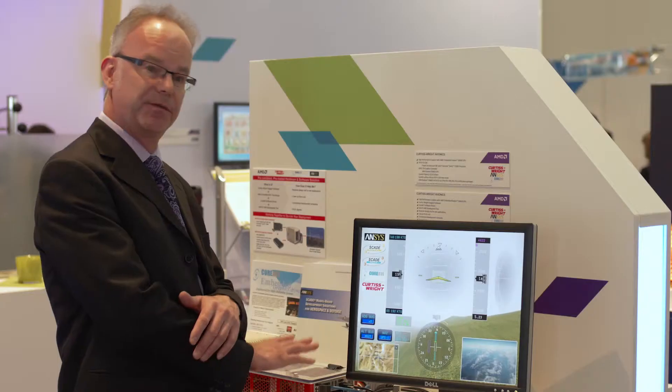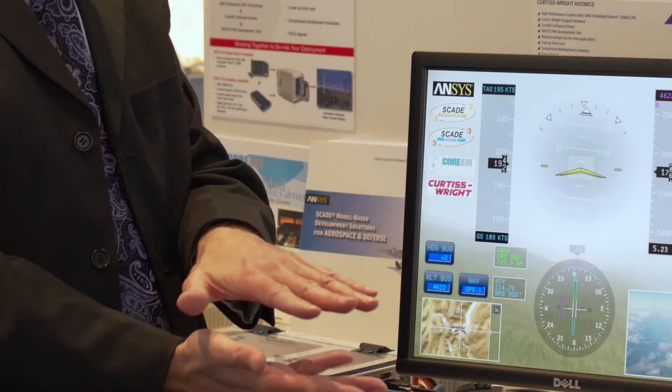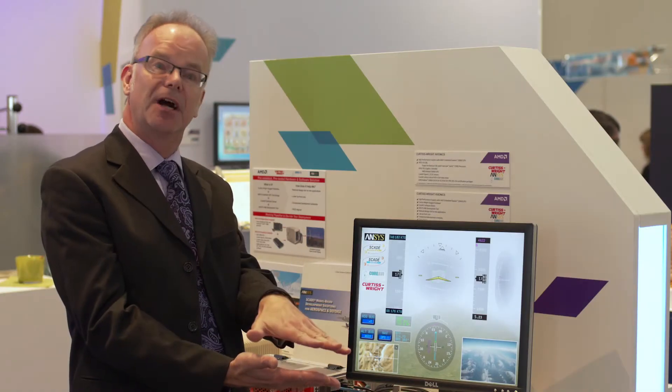What's really exciting about this product is it goes to market as an OpenVPX 3U module. It's actually different from what's typically done, which is a graphics mezzanine on a single board computer base card or host card. We've inverted that so that the GPU is on the base card and the SBC is plugged onto the mezzanine site.